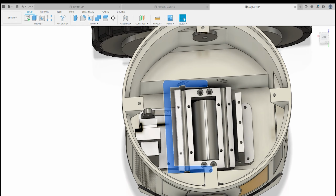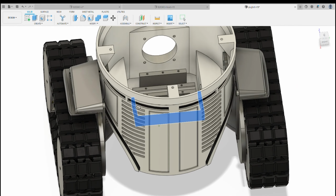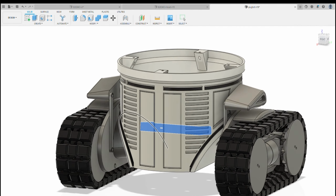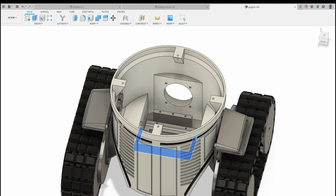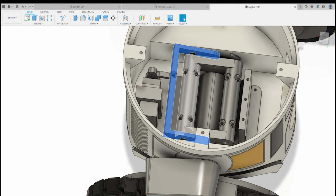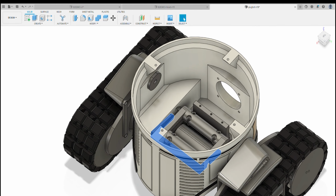So once you've got that in place and you've got the cables out, the next bit you do is slide one of the assemblies on, slide it across with the bars across and with the wing on, and then attach the other one and clamp it down either side. And then you can drop the upper frame and the servo tilt arm just on top of it, and then put your four bolts in so it clamps it all together. Once you've done that, you've pretty much assembled the whole of the tilt mechanism.